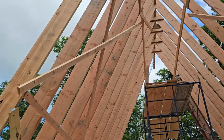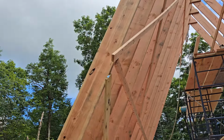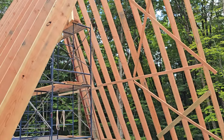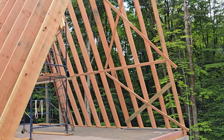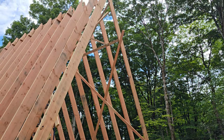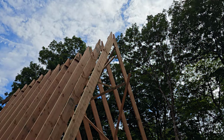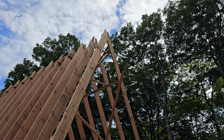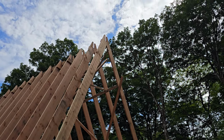And it's also critical that you get it absolutely plumb up and down, because when you go to install plywood or build a wall under it, which there'll be an end wall under each end eventually with doors and windows, it's key that these things are plumb. Or when you go to use your level to install a door or window, things are wrong if the wall leans out. And I've seen this, it really makes it hard to correct for.